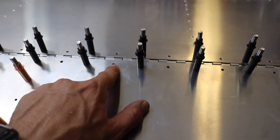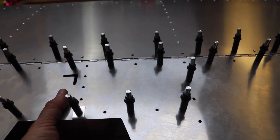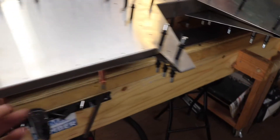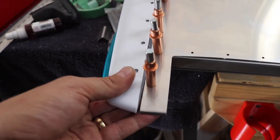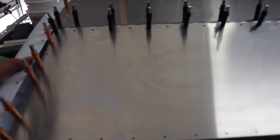Everything has been Cleco-ed in place. I did already open up the holes to the A5 size rivets, so those are all held in place right now. We do still need to do the counterbalance and the control linkages — control horns — on here. We also have the elevator trim that we still need to fit in place and get that hinge in place as well. The gap is about the same on this side too, so we'll make some final adjustments and trimming and sanding of the ABS plastic parts.